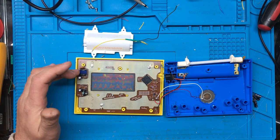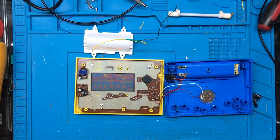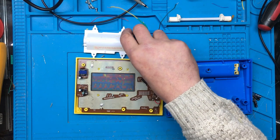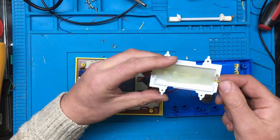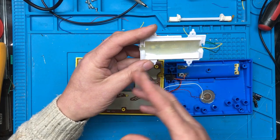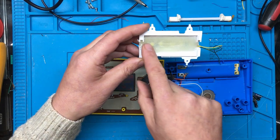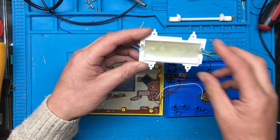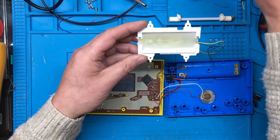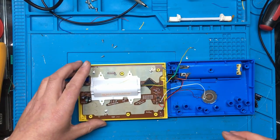I'm fairly sure it's either the transformer or the actual cold cathode tube. All the cold cathode tube is doing is pretty much just a backlight for the LCD, and most backlights these days are LEDs. So I had some LED strip which was 12 volts — I've cut it into different sections, soldered them together, got rid of the resistors, put a resistor in line to limit the current, filled the cavity with glue from a glue gun, and used a grinding pen to rough the surface to try and diffuse it a bit. This is the plan — we'll see exactly how it works out.